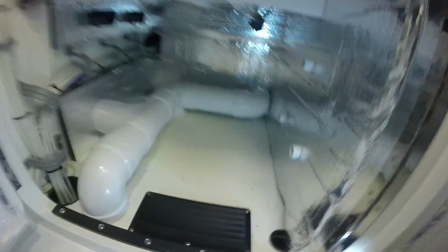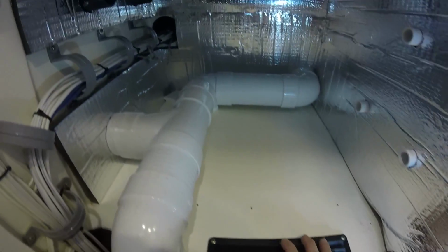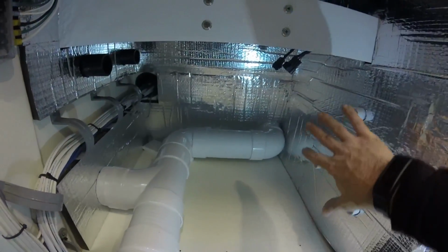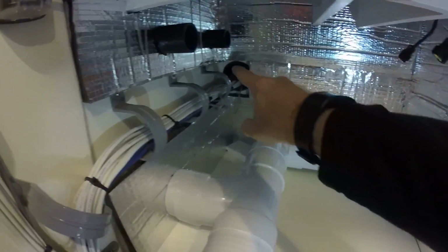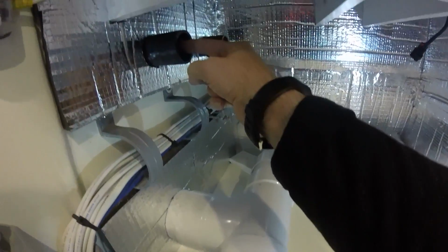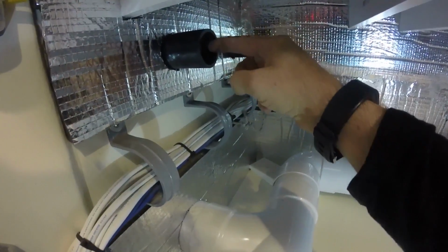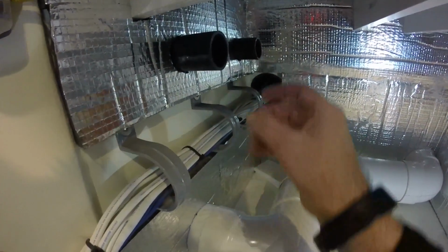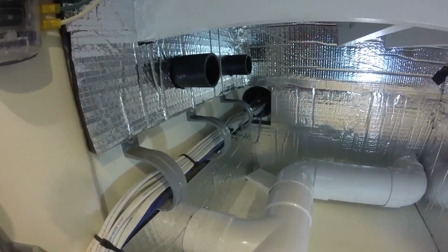Okay, now that I got a little ventilation into this cabinet, I need to still put the tanks back on. But before I do that, let's work on the exhaust. There's 2 exhaust pipes that come out, and they're gonna be centered right through these sleeves. And then I'm gonna pack it around here with glass insulation to keep any of that heat transferring out to the sleeves.